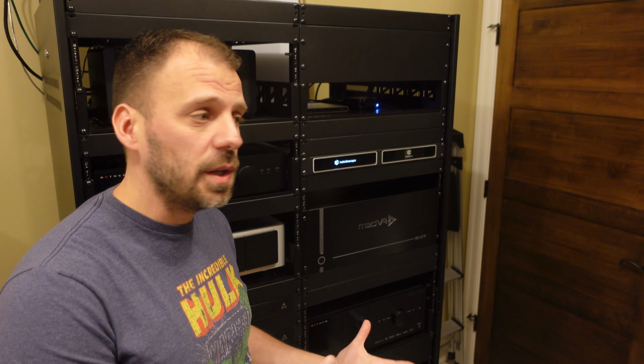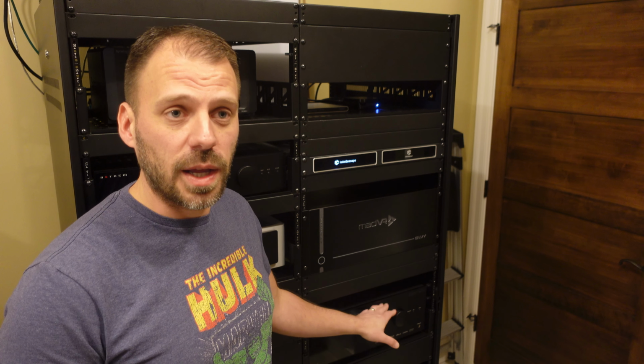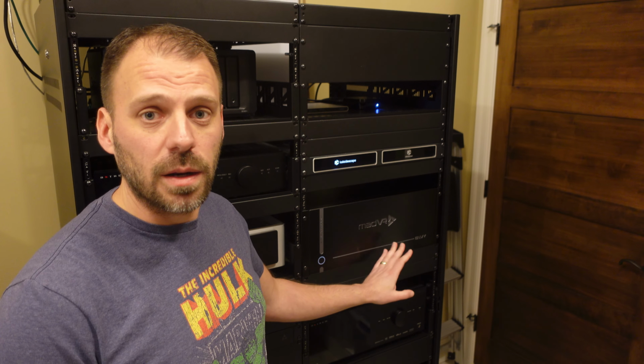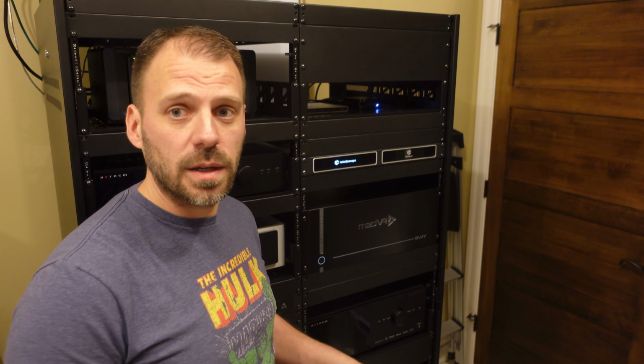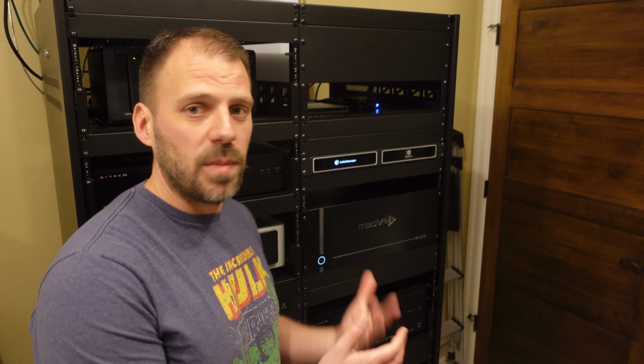Suffice to say that installing this thing was really a piece of cake. I literally just unplugged the HDMI that went from the 90 to the projector, and instead plugged that cable into the output of the Envy, grabbed another HDMI cable, a 6-foot regular cable, just like the ones I use throughout all of my AV setups, and connected that one between the 90 and the madVR. So the important takeaway there is that the madVR is the last device in the video chain before the display.